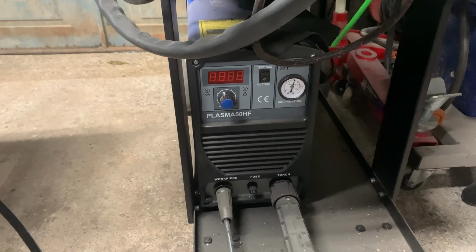Right, the plan now: I've got a plate cut here and I could bob a few holes in. These actuators will actually screw to it in a vertical position. So there are 10mm threaded holes, which I need to cut into the plate, and a 50mm nose on each of the actuators.